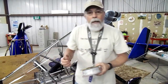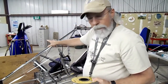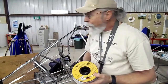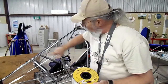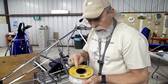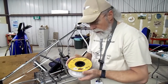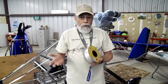I have been contemplating getting new wire pulled in my wings. Right now I have, I think it's 22 gauge. This is 18 gauge. Now I've been told it's a little thick, and I agree. But it's a good sheath cable that can go all the way through the wing. All the conductors are shielded individually, and then all the conductors have one main sheath that goes around all of the rest of them and keeps them protected. So it's got really good protection.